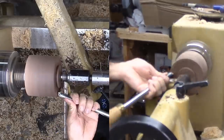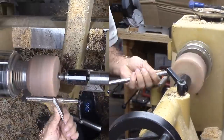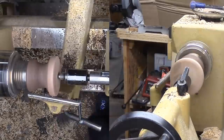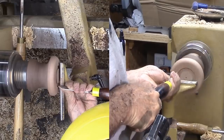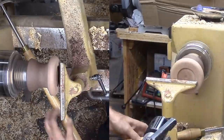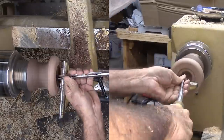This is primarily large gouge work. After some additional wood removal, I'm tackling the interior. Here, I need a mortise for when I reverse the hat again to finish the exterior. The hat's brim provides enough strength to resist cracking under expansion pressure. Then I can go on to hollow out the interior. Looking back, I should have taken more out, but that's okay anyway. I smoothed out the interior with a round nose scraper.